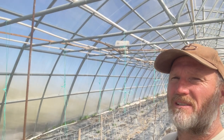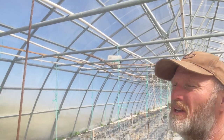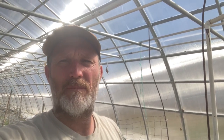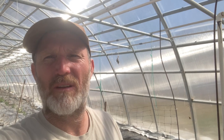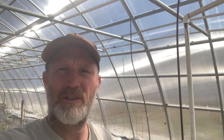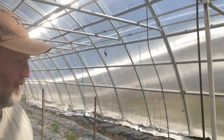One thing that's really unique about this is the water delivery system. We're completely off grid here. This is an overhead — you'd call it a drip line — but a classic drip line is under pressure. This is under very, very low pressure, just a few PSI. But by having oversized lines and larger holes — the holes are at least a sixteenth of an inch — it allows you to have a lot more water flow at less pressure, and it maximizes your solar power capability.